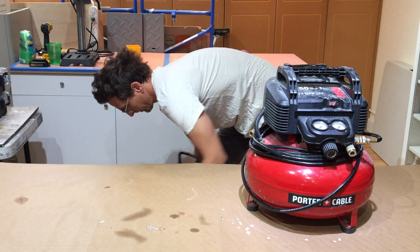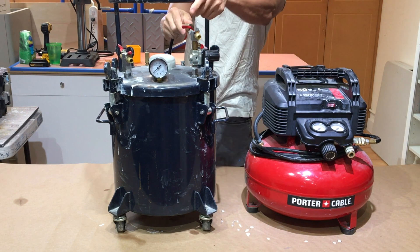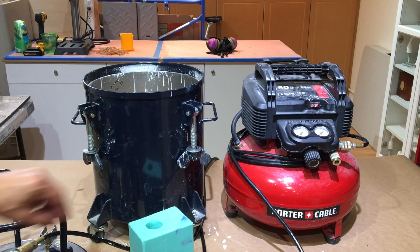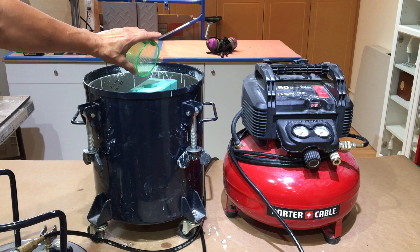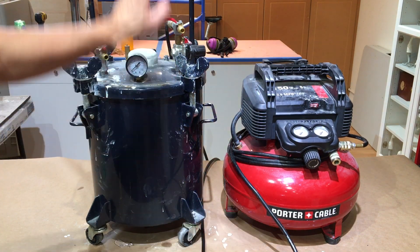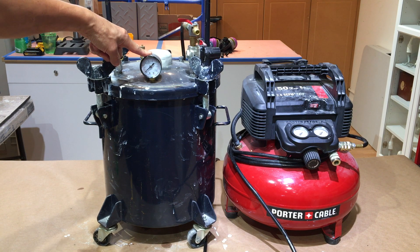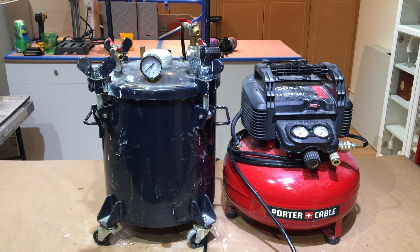So now I'm going to explain the pressure casting process. In the future I'll have a separate deep dive video, but I'll go over the basics here. First you place your silicone mold into the pressure pot, mix up your resin, pour it into the mold, then clamp down the lid so it's totally sealed. Then you turn on an air compressor which pushes air through a little tube into the pot until the gauge reads 40 to 50 PSI — that's pounds per square inch of air being compressed into the pot and into the resin. You leave the resin in there until it's cured. In theory, all the little air bubbles have imploded and disappeared from the air pressure, so you get a casting that is completely bubble-free.